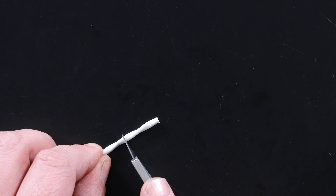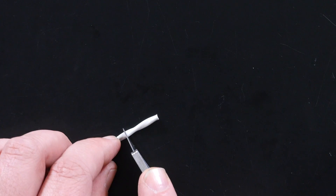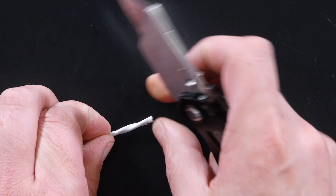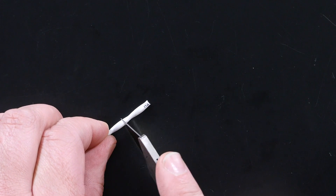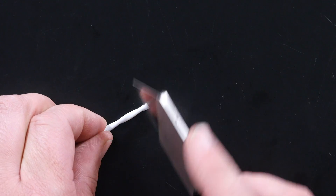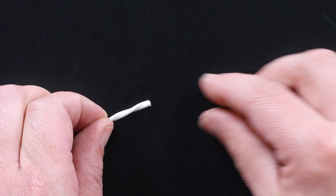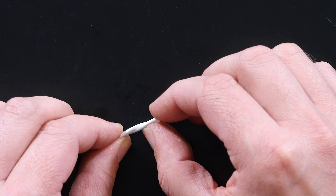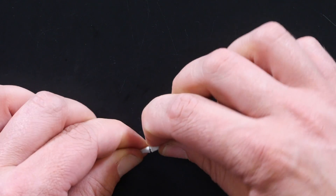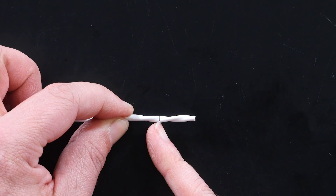What we want to do is simply score a ring around the wire, and you can do this by rolling the wire on the bench while holding your knife next to it. If you do cut through the cable jacket, it's not the end of the world as you're not likely to nick the wires underneath — the shield jacket will do a pretty good job of protecting them. We'll score around that, then bend the wire so the shielded jacket breaks along the score line, giving us a nice clean break.